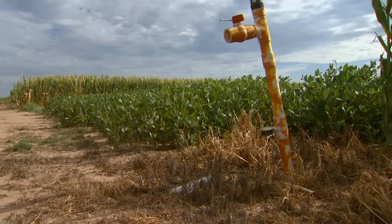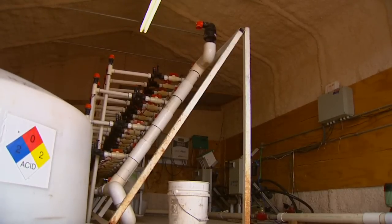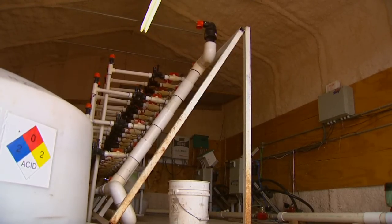We have to tie it all together back to the water source. And one thing to keep in mind is effluent is only a small part of what actually goes through this. We put on typically about an inch and a quarter to an inch and a half of effluent every season, and we're putting on maybe 12 inches of fresh water irrigation from the Ogallala Aquifer as well.